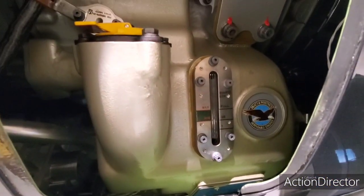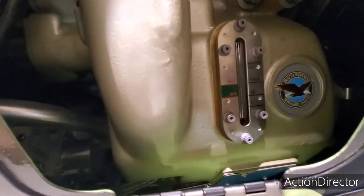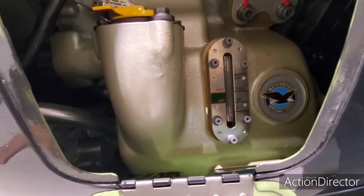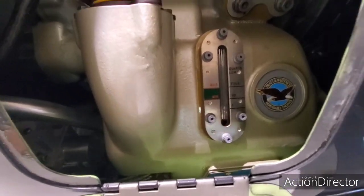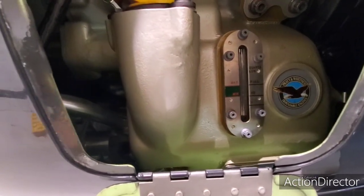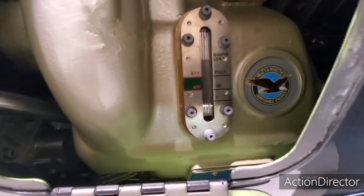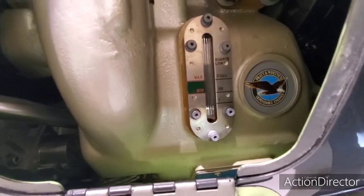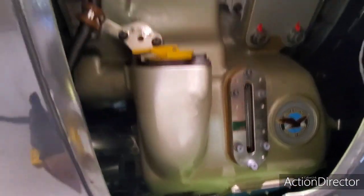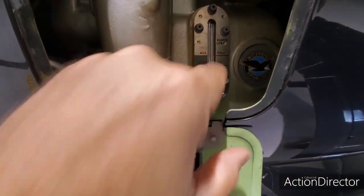Now you come up here and you think oh my god, it's so low. If you notice the oil in there, it's below the one quart add line. If any of you have been around jet engines or turbine engines of any kind, you check the oil within 15 minutes after shutdown — it might even be 10 minutes in this airplane. Last time I flew, I made a note that it needed oil. We're going to put half a quart in each engine. The plane's been sitting seven days, so looking at the gauge now means nothing. Pratt & Whitney will tell you if it's low — motor the engine, then check the oil. So you make notes when to add. I'm by myself so you're not getting a lot of action shots since I don't want to spill oil everywhere trying to get a video of the shot. We're going to put half a quart in each engine because I made notes last time I flew.